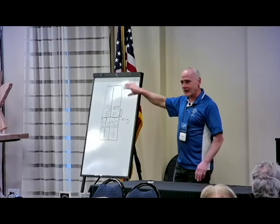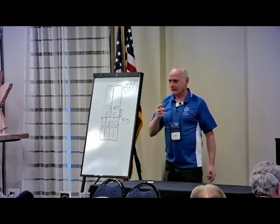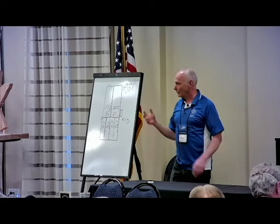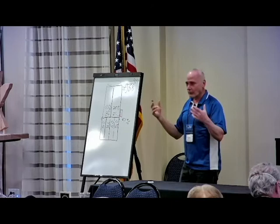Now, with wood, when we start a day, when we're ready to light the fire, the first step should be to brush the flues. We're going to get carbon buildup on the flues, and we should take a flue brush and run it through there and get that carbon off. Second thing we do is to shovel the ashes out that we made yesterday, and then we're ready to kindle up a fire and make it go. Now, all of that procedure that I've just described, if I really hustled, that would take me an hour before I even light the match to start a boil.